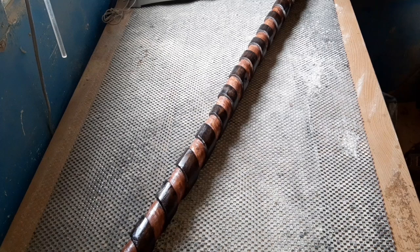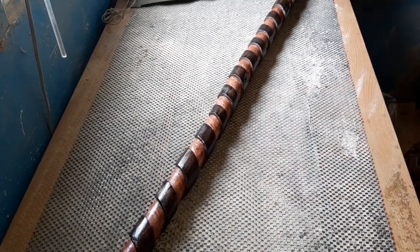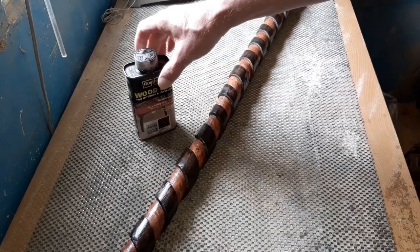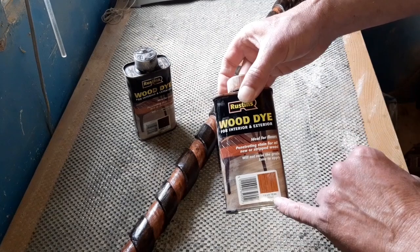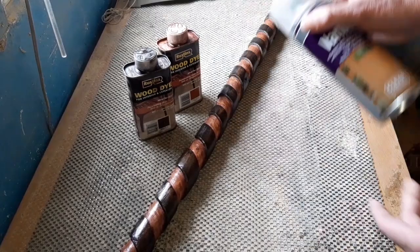We had a Plan B. Unfortunately I've got no video to show you, but all we did was use a wood dye — dark teak — and just painted it on. It soaks in really nicely and goes on really easy. Two coats of that, then I used the same wood dye in light teak on the inner sections. When that was all nicely dry, I went over the full piece with some cheap yacht varnish — three or four layers out in the sunshine — just to give it a nice shine and finish.